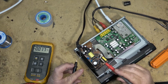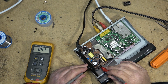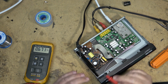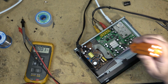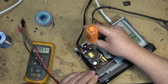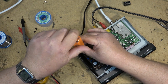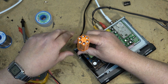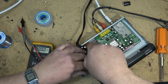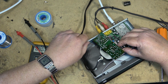Okay, I've got my DC voltage charging up. I've got it unplugged now, so I'm just watching it discharge. But we have no start. Now this cap usually is the one that gives it a kick, so that one might also be bad, even though I didn't change it out. It measured okay in circuit, but it also could be the MOSFET may have failed. With that cap going open like that, there would have been excessive ripple, and that excessive ripple could have damaged the MOSFET itself.